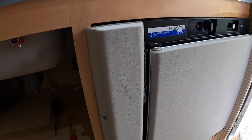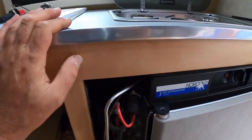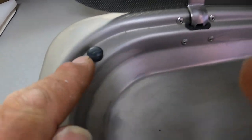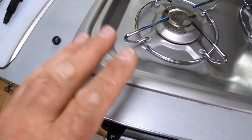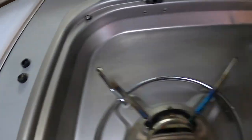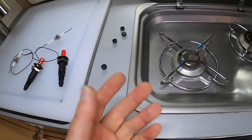We're just going to clear this area out so I can get up in there. Now I've got the refrigerator panel off. I want to show you something people are not aware of. This is a Dometic stove — see these little rubber bumpers? They're not just rubber bumpers. If you pull this plug off, there's a screw underneath. Turn those screws about 90 degrees and a little clip underneath will move around and the stove can lift out.